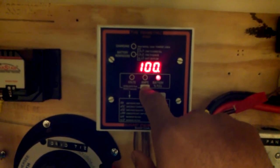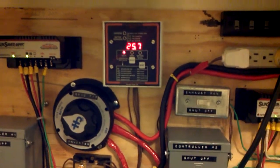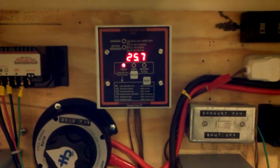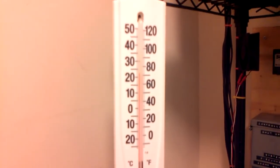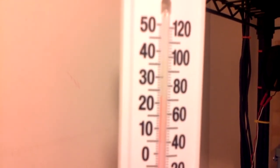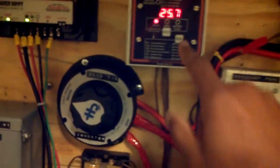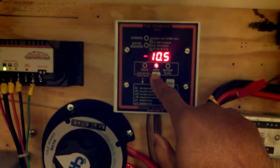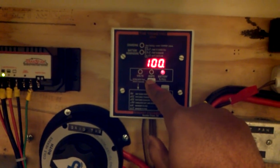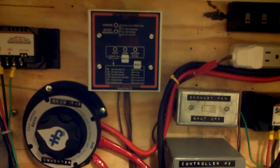The experiment started roughly around 8:30 or so. The weather conditions — I would only propose doing this during a sunny day where everything is good to go. Local temperature on the outside is about 46 degrees. Ambient temperature inside this room is about 71 to 72 degrees. Voltage is at 25.7, holding steady, taking out about 10 amps from the battery bank, and it's at a full charge. Local time now is 8:43. Stay tuned, YouTube — this is part one.